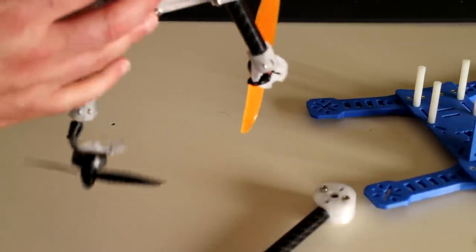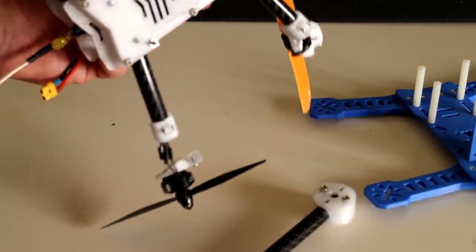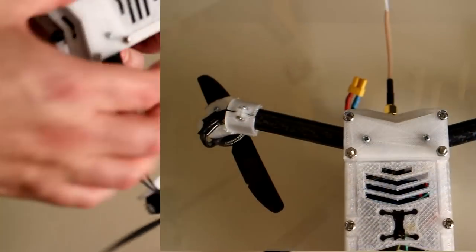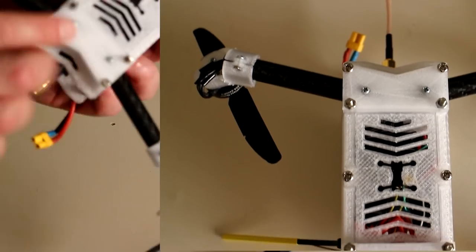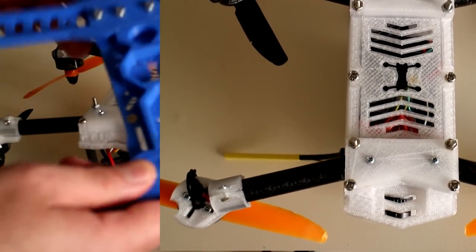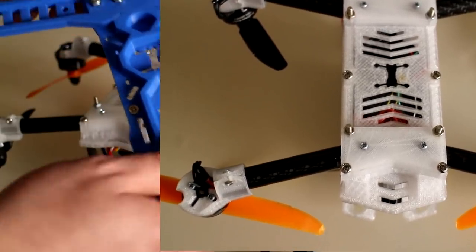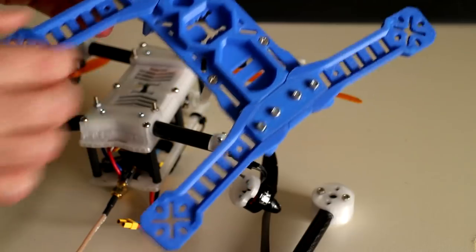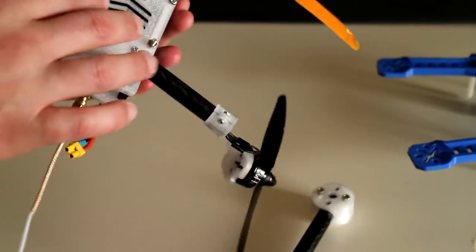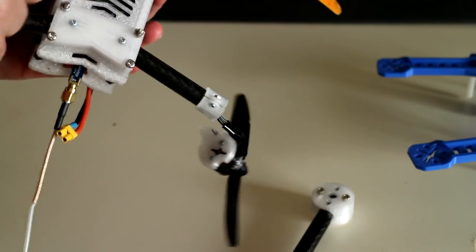Another upgrade with the Peon 230 Pro is that because we're using a tube, why not run the motor wires through that tube and have the ESCs nestled away within the skeleton of the base of the frame. Going back to the original Peon, we have this skeleton which provides all the strength for the base — hence why parts really only break on the extremities. So why not utilise all that space for the ESCs? That's where they are currently.